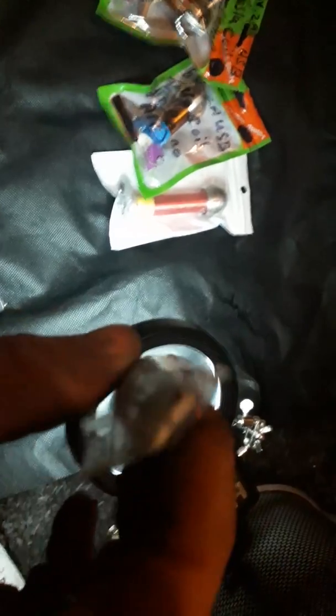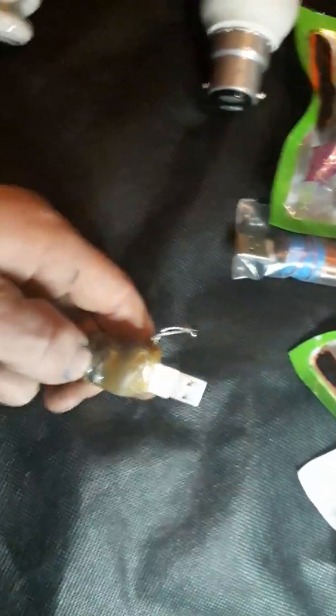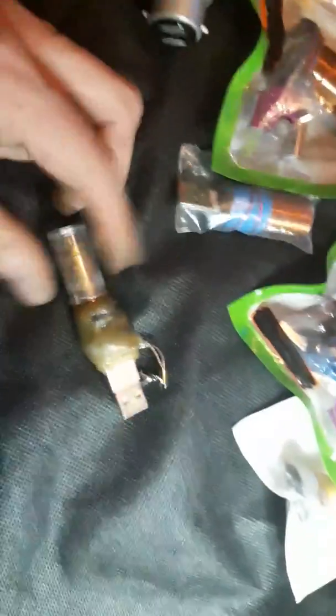The whole point of that is you can see through it, and there's no chipping. It's literally one transistor, one resistor, and you've got it working. You can even see the little resistor there. I've actually left it slightly exposed so that I can see which colour it is, because I went through a stage of getting the wrong resistors. The 100k resistor won't work on this — it's too many ohms. You need around 10k to 20k, about 30k tops before you start losing power.